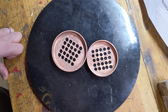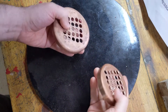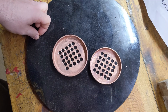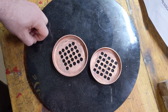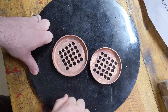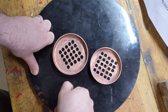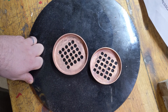Okay, so you should have just seen a montage of me finishing these off - these are now done, complete. That is eight millimetre holes, so eight mil rather than five-sixteenths, just for a bit more clearance around the actual fire tubes themselves, to give better penetration for the silver solder, which we'll get to at a later date. So that's the wrap for this section. Next section we'll be concentrating probably more on the fire tubes and also the inner boiler barrel, which I guess is also the firebox.